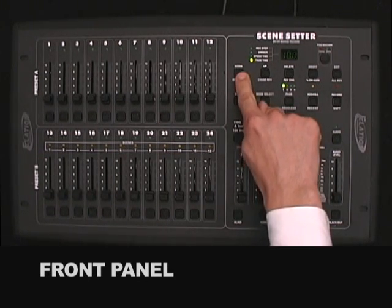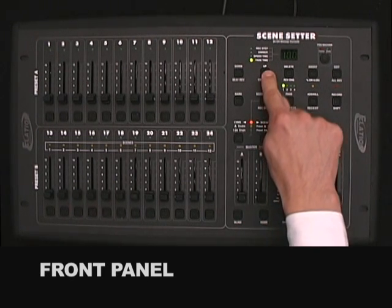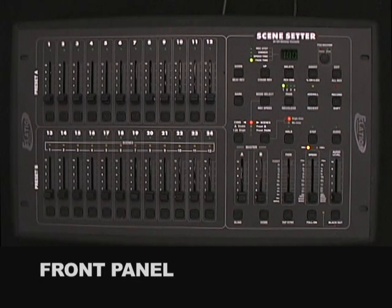The down beat button. This is a multi-function button. The down function is used to modify a step when in chase edit mode. The beat reverse function is used to reverse a chase direction in audio mode. The up chase reverse button. This is a multi-function button. The up function is used to modify a step when in chase edit mode. The chase reverse function is to reverse a chase direction under the speed fader control.